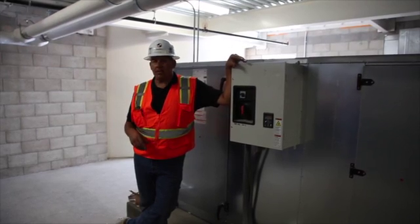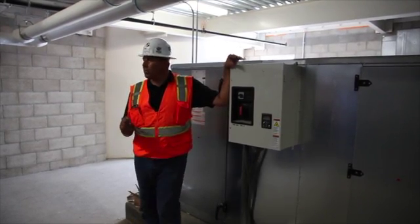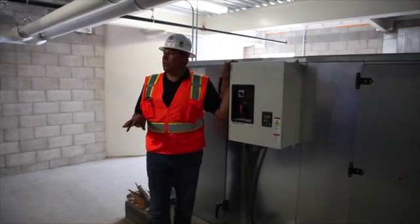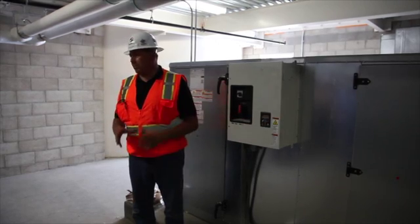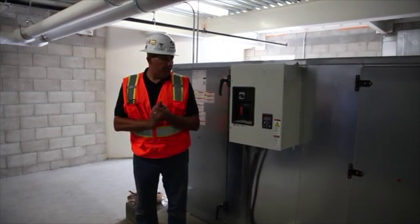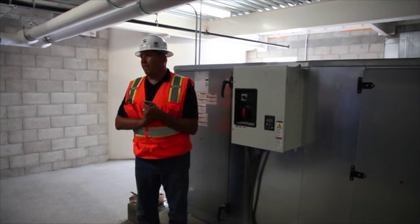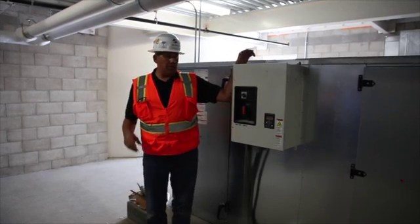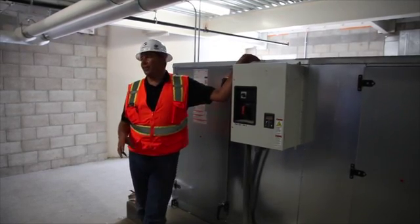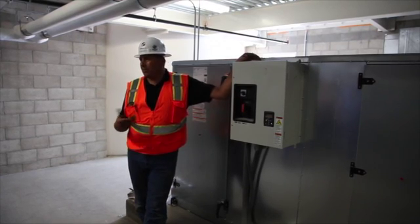That's how these work — basically you're making a simulated AC sine wave for the leaving voltage going to the motor. There's a keypad and manuals available here. One thing about the inverters: you want to keep them clean. There are small fans inside that help ventilate the cabinet. If you're working around 480 volts, obviously you follow your own lockout/tagout procedures to stay safe.